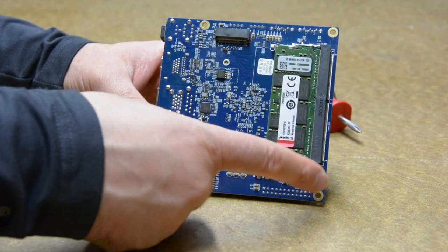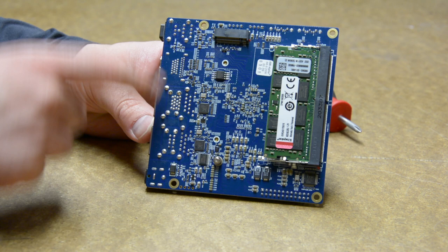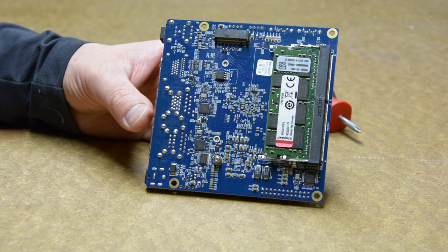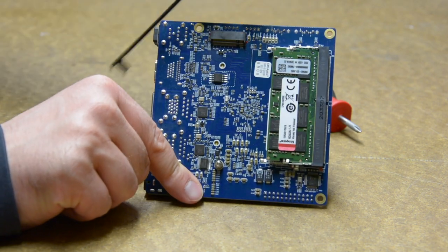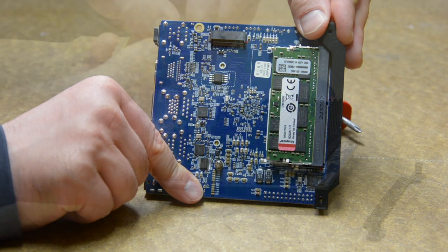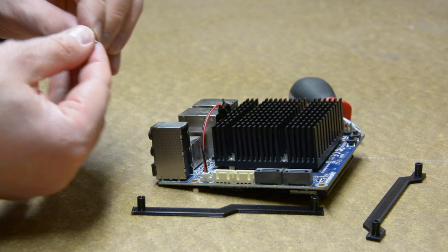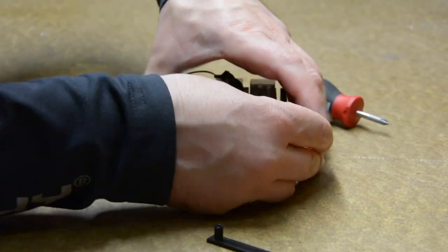Next is the motherboard. It has two sets of holes for flat-headed screws. The problem is that one slider has to go around the RAM connector and the second set of screws are in different positions. A bit of trouble with the design, but it came out perfect on the first go. Since I need to fasten the screws into the hollow plastic columns on the slider, I'm using B3 screws made just for that.